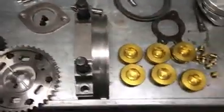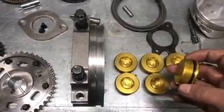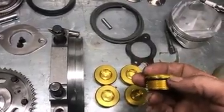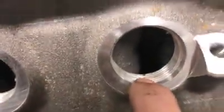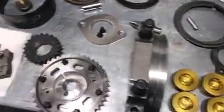New things that we've done this year is we have changed the type of plugs that we use in the block. They actually seal with a metal-to-metal seal, but they also seal with an o-ring that goes in a particular machined area. It is a double seal so that the material is not being tightened down just on the o-ring — it actually seals on the metal itself.